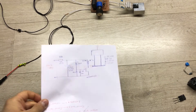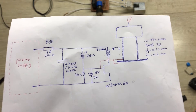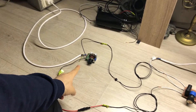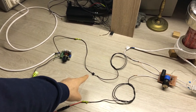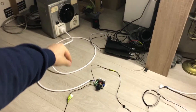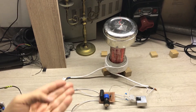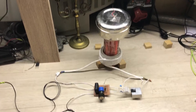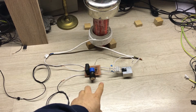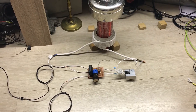In the previous video we built this circuitry. I showed that if we use an adjustable voltage regulator together with a single diode after our power supply, which comes from a variac, we can drive this circuitry and achieve satisfactory results from our single MOSFET solid-state Tesla coil. This circuitry is self-oscillating and does not have a gate driver.